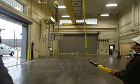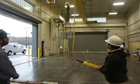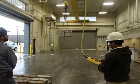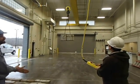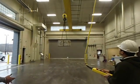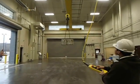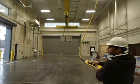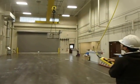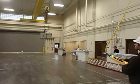Is it safe to push all the buttons all at one time, Mike? You can move multiple axes at the same time. I would never move multiple axes at high speed at the same time with a load. So you want to keep everything at a slow speed, and you can do all your axes all at once. It's a smooth movement. You can move it over and place it down all at the same time, but you just have to do it smoothly.